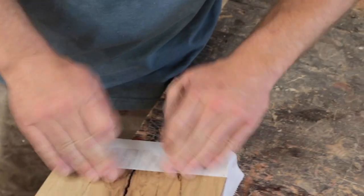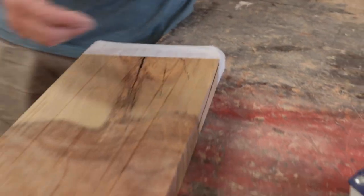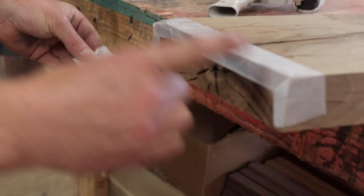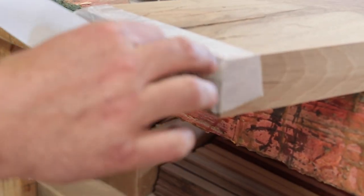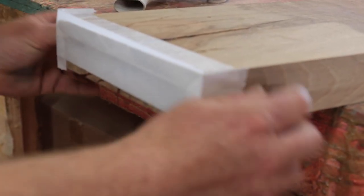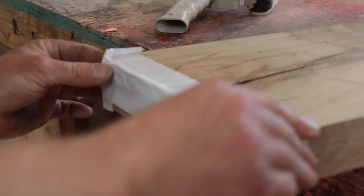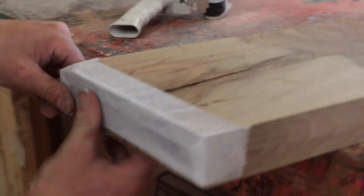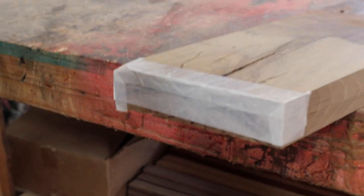I'm just gonna try and make a watertight seal, basically on the bottom and all the sides of this thing, and then we'll flip it over and pour it from the other side. Whenever I overlap my tape, like especially right here where I've got a little flappy, I'm gonna go clear above that. You gotta think water. You gotta think you're literally making a reservoir. That deep pour epoxy's so thin, it'll find any little crack and escape. Yeah, you wanna just go the extra mile. Make sure that you get it, even if the tape's so damn expensive.